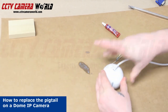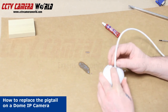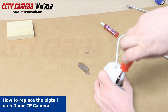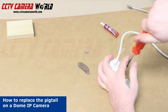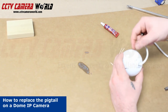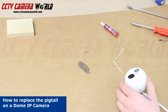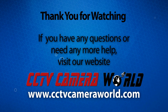Put both ends of the housing flush together, making sure the screw holes on either side of the camera match, and then screw them down to secure the housing together. This is a lot easier to do with the Allen key tool that you receive with the camera, so make sure you hold on to that. Now that the camera is reassembled, you can go test it out. Thanks for watching. Questions or comments? Use the discussion box below the article.